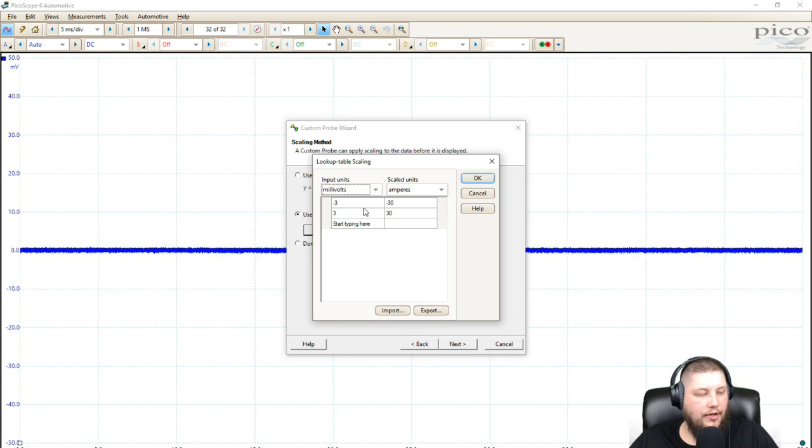A good maximum negative amperage scale we would read on this is probably negative one amp. Normally we don't use negative amps, but you want the number to not be zero — because if it's zero, your zero line is at the very bottom of the oscilloscope screen and it's difficult to zero. So we know one amp is 100 millivolts, which means negative 100 millivolts is equivalent to negative one amp. Our maximum on this clamp is 30 amps, so 30 amps at 100 millivolts per amp is 3,000 millivolts equivalent to 30 amps.